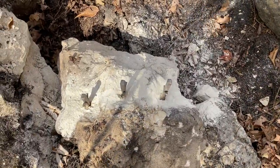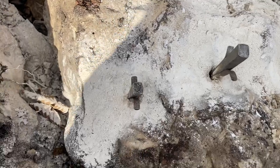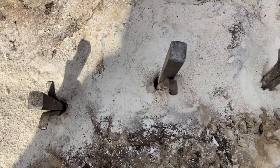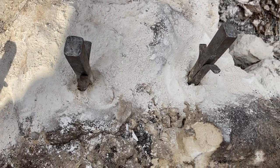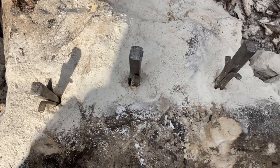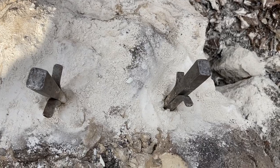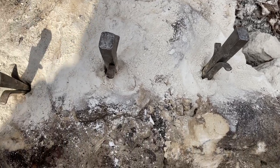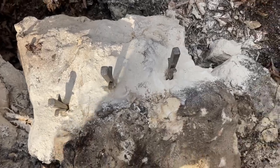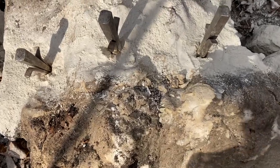Once these are in place, the idea is that the feathers are on either side of that metal wedge — it's all tool steel so it's really hard — and as you drive that metal wedge down, the feathers push out and the rock will break. A key is having your wedges aligned along where you want the rock to break, just working them down a tap at a time, and you'll hear the sound change.